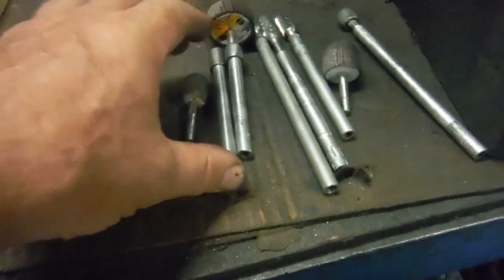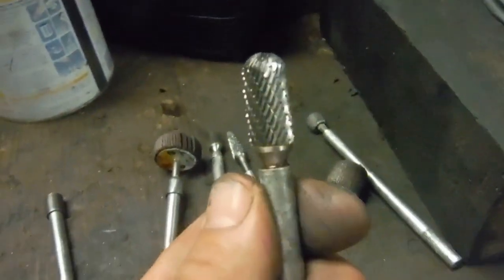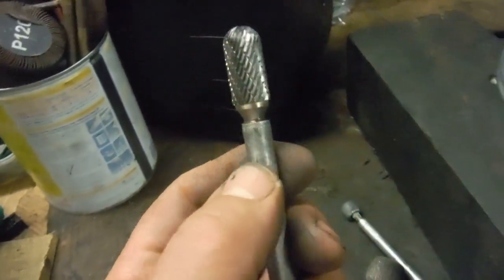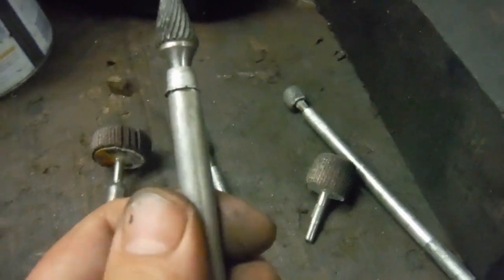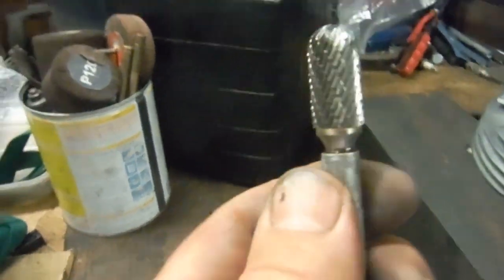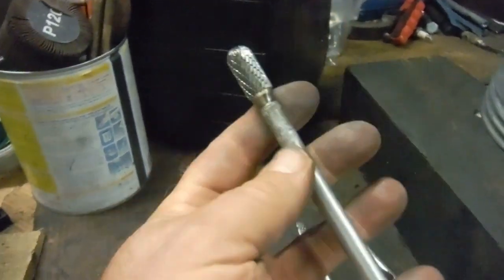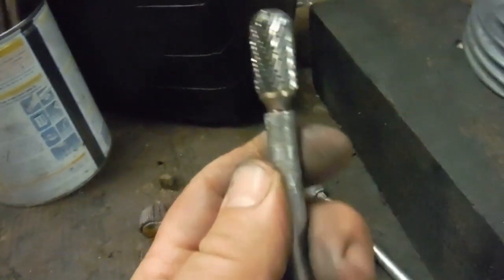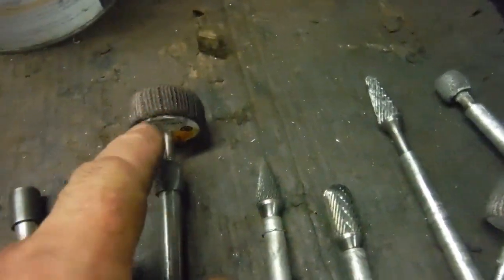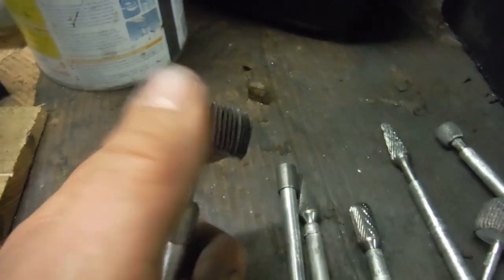A full length push rod would be nearly twice as long. The deburring tools are a little bit of a different matter — they'd be more difficult to cut a thread into their stems because they're HSS steel. But a couple of them are actually more or less a press fit or tight push fit into the push rods anyway. One I fitted today that slid in a bit too easily, I just applied some bearing fitting compound to that and it's locked it into the push rod nicely. It doesn't really matter that they're locked in because these last a lot longer than the flap wheels, which wear down quite quickly — you want to get them out, change them, and it's just a matter of unscrewing and screwing another one in.